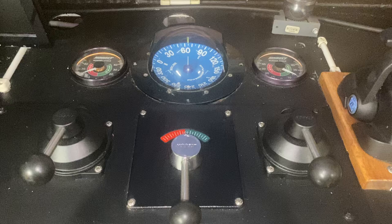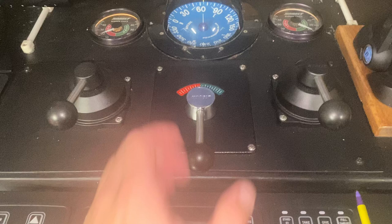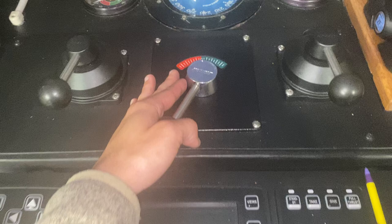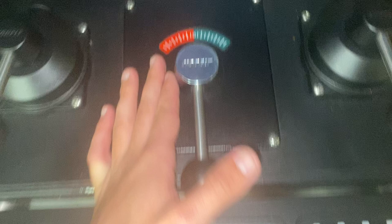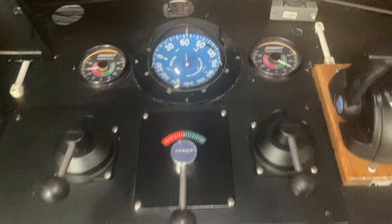When we're steering we want both rudders to be synchronized, and that's where full follow-up comes into advantage. Now Cobalt works a little bit differently than many brands. In many cases if you move the lever to port the vessel will go to port, but in the case of Cobalt you can see that moving it is actually moving the vessel to starboard. We are currently in non follow-up mode — these exterior levers are in control — and in fact one rudder is moved 10 degrees further than the other, and they're also in opposite directions.